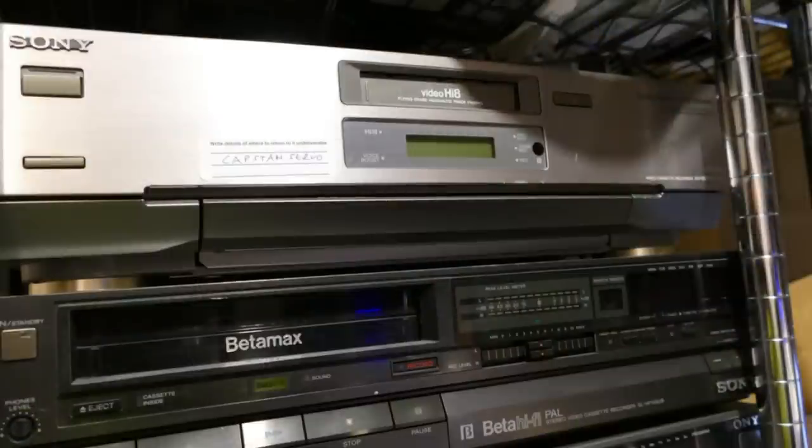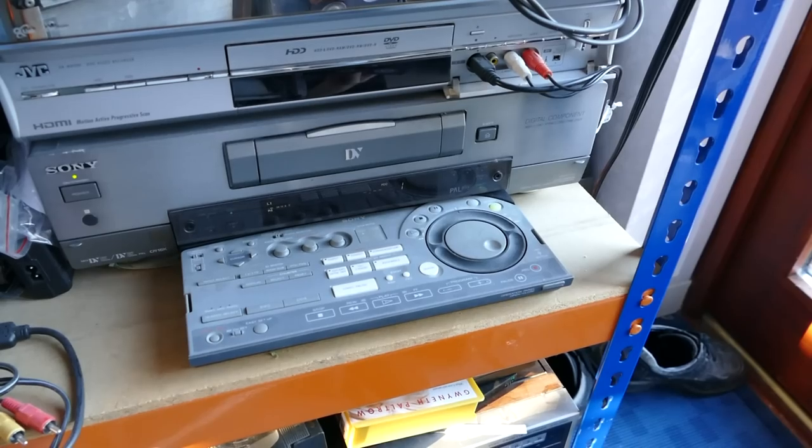Now, I have another one here. This one I bought back in around 1996 and it cost me some £1,500. The capstan servos failed, so the speed is erratic. Capacitor trouble, of course. So that's another one to repair later. So it feels like we're coming to the end for these machines. It was a legend in its day, but its days are now severely numbered.